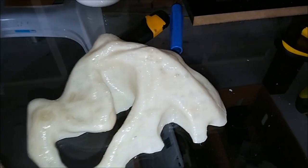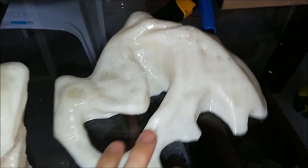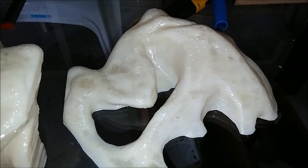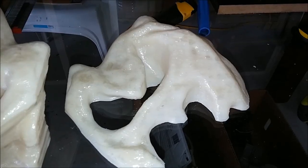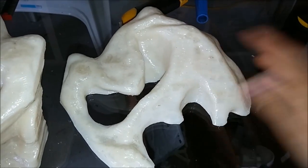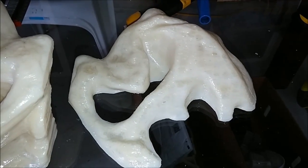So that's coming along quite nicely. For the next extruder I'm going to put on the printer, I'm going to have a 1.5mm or 2mm nozzle — I haven't quite decided yet. I'll probably print with one perimeter and two tops and two bottoms for this sort of sculptural stuff, which will give it a bit more infill and fewer holes, but will obviously use a lot more plastic.